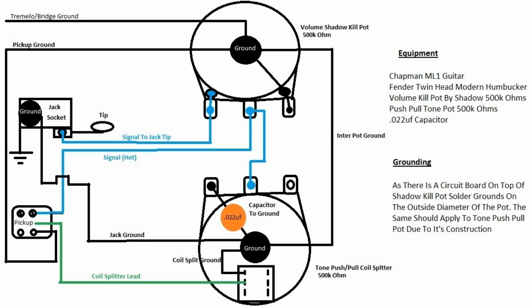Now both these come off the wiper, which for those of you who don't know, the center connection on each pot is what they call the wiper that wipes across the resistor within the potentiometers. Just have a quick theory lesson here, because this would have helped me understand things a bit better. I'm not a professional electrician or electronics engineer, but when things are explained to me, I understand them a bit better. Now, you'll notice they're placed in a mirrored position, and the reason I do this is because it makes it easier to wire up and less messy.